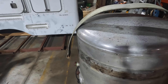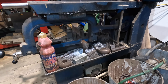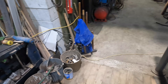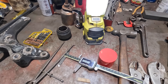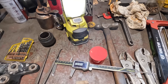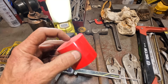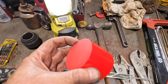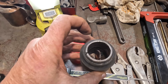I'll sit and discuss the paint scheme later on — I just don't want to throw that out there at this point because I'm not finalized on what I'm doing there. So here I'm cutting off a bit of bar stock. I was going to buy the bushes for the front cab mounts and pivots, but they failed to turn up — out of stock and all sorts of issues trying to buy online. I went to the Kenworth dealer and it was just over $300 New Zealand for two bushes. So I went to a plastics company in town — polyurethane — and it cost me $38 New Zealand for two of these. I've watched a few YouTube videos on tooling and what they do. I could have a big failure, but you don't know unless you try. So I'm going to manufacture this part in the lathe and attempt to bore this polyurethane out.